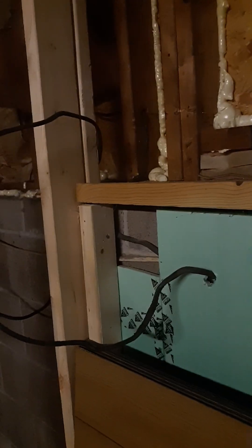Going back over to this wall — I got that all studded and it actually turned out very well. I was pleased with the way it turned out. There are a few things over here — this two-by-eight was actually somewhat twisted, so I've got to make some modifications to kind of bring this end of it down so that it's a little more even.